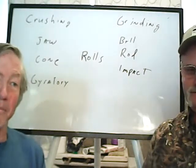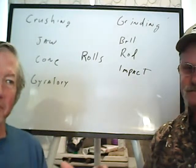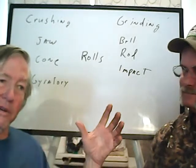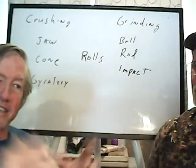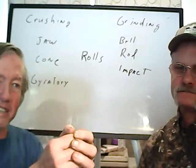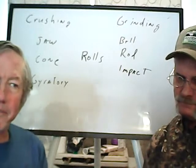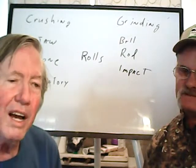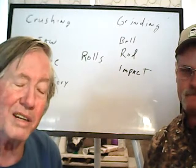Lauren reported there's a lot of manganese dioxide in it, but the flux itself is what absorbs the microwaves. So the microwaves go through the ceramic foam, they go through the crucible, they hit the flux, the energy gets dumped into the flux, and so the heat is actually coming from inside the crucible outwards. And possibly, Chris, that's a good idea. I've got some magnetite out there too. We could try making some stuff.